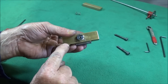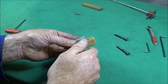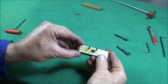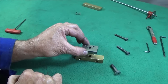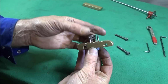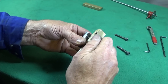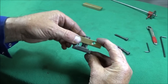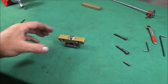I then bolted it together tightly with the 8 millimeter bolt and drilled right the way through to accept a couple of roll pins. Those roll pins are a tight fit in the brass, then I drilled out the T-nut so they become clearance holes for the roll pins. I found a spring that goes in the center — the bolt goes down through that spring and screws into the T-nut, and the roll pins keep the T-nut in position, just like the other one. You've got a simple locking device and when it's on the lathe you don't have to reach underneath either.